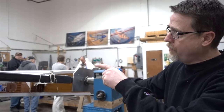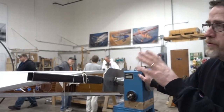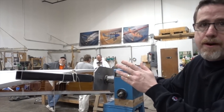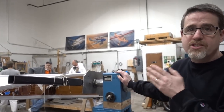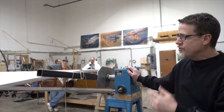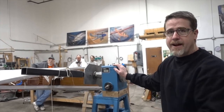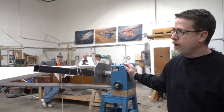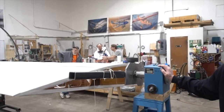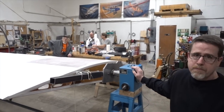This is the left wing. So today we painted orange in the paint booth. Tomorrow we're going to roll this in there and shoot it with primer. So this is about a 23-foot wing, so it is huge. And so it'll take Bill and I both painting. And we'll put two coats of primer on it tomorrow. We'll let it set for a day or two, sand it. It'll get two more coats of primer, and then it'll be ready for orange.